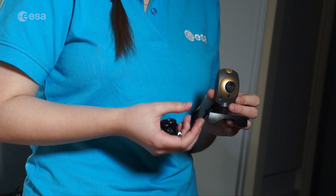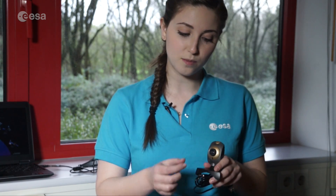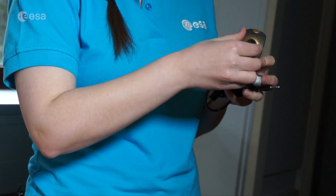First, you're going to need a cheap web camera such as this one. I've chosen this one in particular because it has a manual focusing ring. This is useful because the entire focusing ring can be removed, allowing easy access to the lens inside, and more importantly, the infrared filter. Most web cameras have an infrared filter in order to increase the quality of the visual image, but if we want our camera to be detecting infrared radiation, we need to remove that filter.